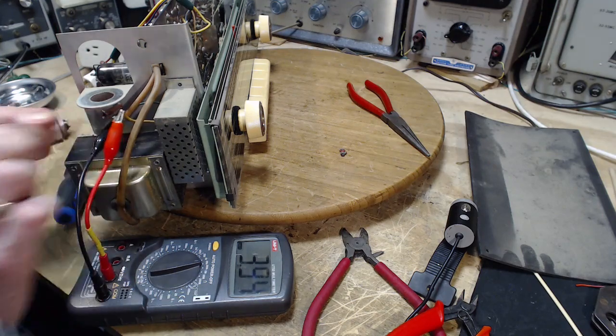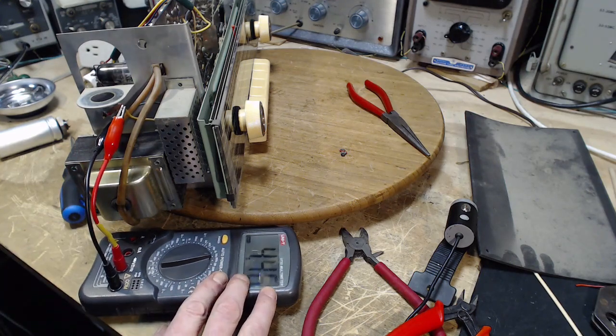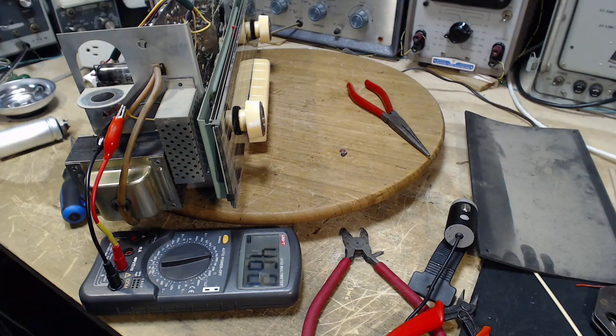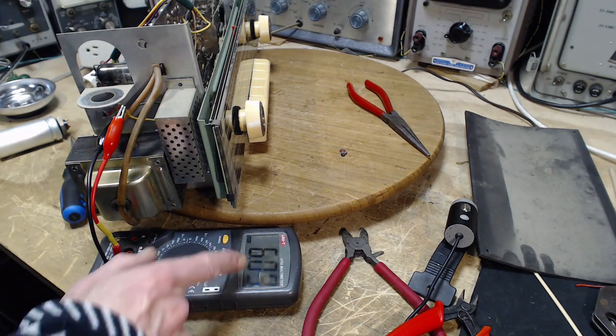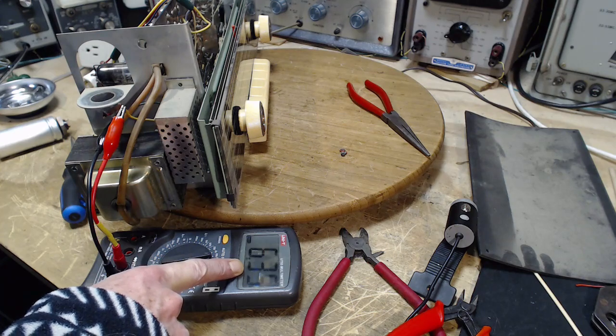Okay, what's the resistance of that resistor? 4.2K ohm. And now I'm just going to peek myself up on the schematic here, where we see it should be, I think it's 1K, just one moment, I've got to zoom in on here, so small the writing. I think it's supposed to be 1K. 1K 8-watt resistor. And I just measured it at, what's it doing? 6K.